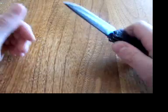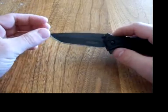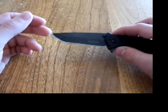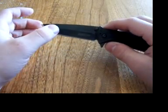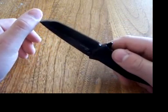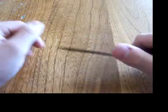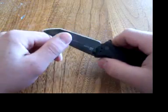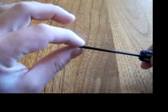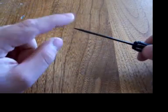I just really like resharpening blades. I resharpen Spydercos, and they all come stupid sharp out of box, so it's just something I do to make sure that it's up to my standards. It was sharp out of box. I backed up the relief edge ever so slightly, and then I changed the relief edge on the tip to make it more of a true flat grind, or maybe a convex grind right at the tip, because it makes it a little easier to sharpen instead of having to figure out angle changes from a flat to a hollow grind. The flat also makes it a stronger tip. Instead of having a hollow ground tip, it's a flat, so you have a little bit more metal behind that very pointy tip.